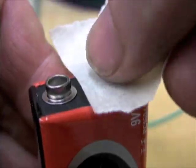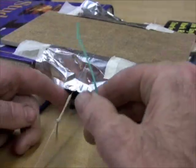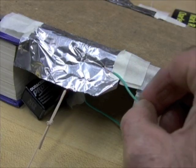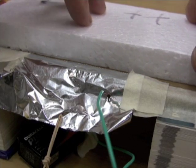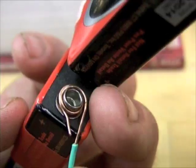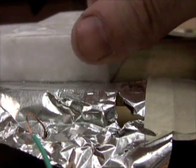This'll be some pretty crude wiring, but I said simple. I stick the battery out of the way under the board. I'm taping one stripped wire to the far side aluminum, and my switch is just keeping the other wire touching like this. The hot wire makes electrical contact with the aluminum, but it can still stretch and float. With only one battery, you'll cut very slowly. You can also hook up a second battery in series to speed up the cut. If you don't leave the wire connected, you can get a lot of cuts per battery. If you do a lot of this, you'll get an adjustable voltage supply, like a train transformer.